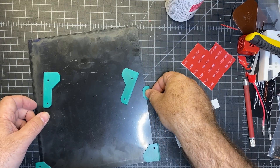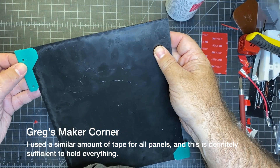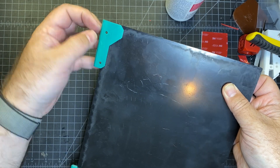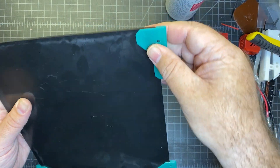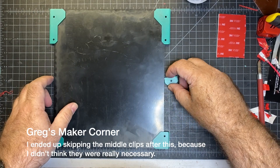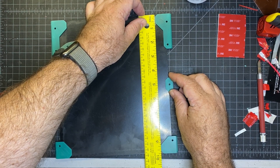You also have to put this middle piece on — it goes like that. I just wanted you to see the placement of the tape on these. You're going to line them up at the very top, all the way in, and make sure they're flush. I notice there's a little tiny bit of overlap with the screw hole, so you might have to back it up just a tiny bit — I don't think that's going to be an issue. For the middle one, I'm going to measure it and split the difference — mine was about 250 millimeters top to bottom, so I'll go right around 120 to 125 millimeters.